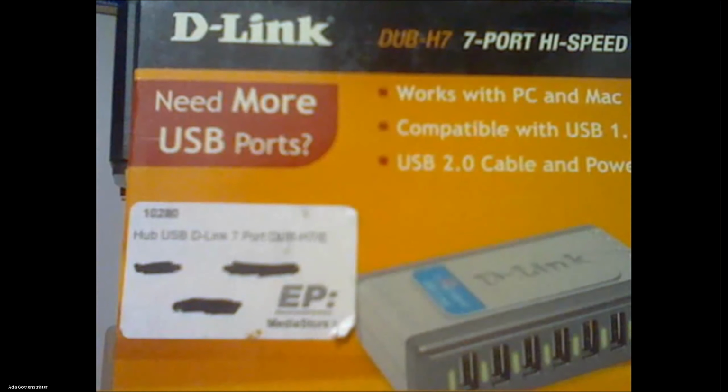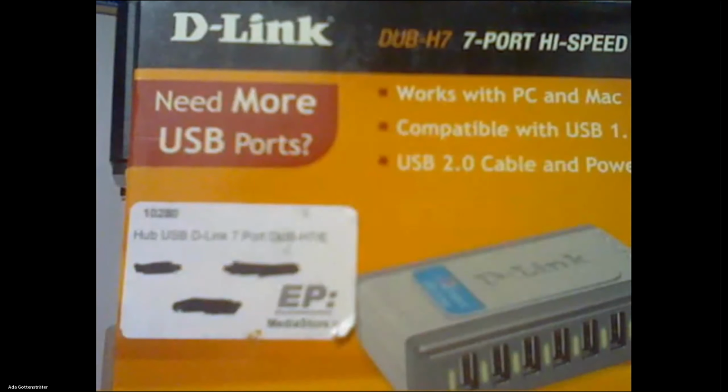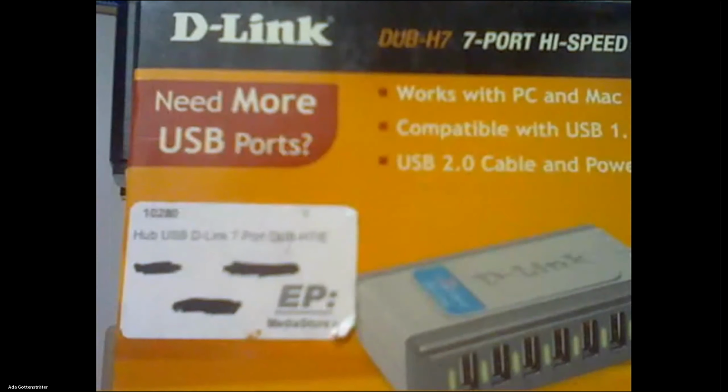How big did this thing wind up being in code? Actually, just very small. It's very modular, so you can only enable the features that you need. The version that I'm using in the Neo Geo emulator, which I'm compiling as a separate thing, so I know how big it is, is 9,265 bytes. Wow, that's very compact. I always figured that's how it should be, but the complexity comes when you're handling things like the HID protocol or the mass storage class protocol. But it handles most of the HID protocol as it relates to game controllers. So it can decode the descriptors and figure out what everything has. What this version doesn't have is the mouse support. That's disabled. If you added the mouse support, it'd be slightly bigger.